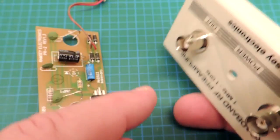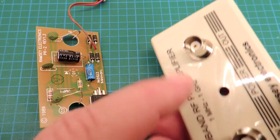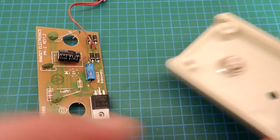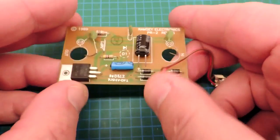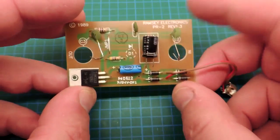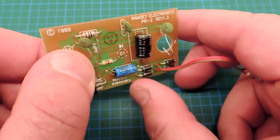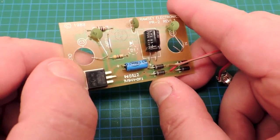It actually proved that even when I put a shorting 50 ohm resistor on the input, the output still shows a signal. That's because it's basically picking up noise or signals through the leads of the capacitor. So it looks like a really simple assembly, but it just isn't very well designed for my purposes.